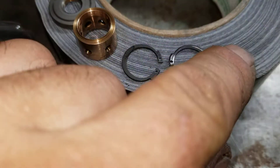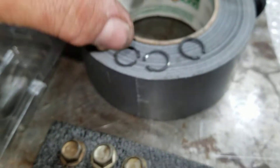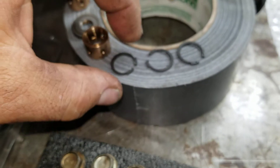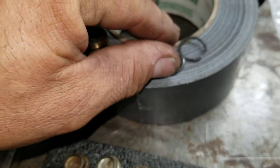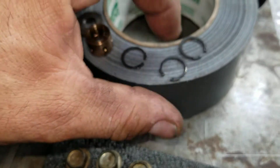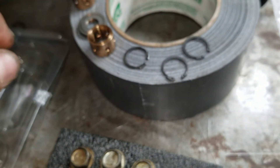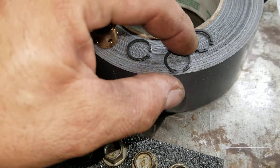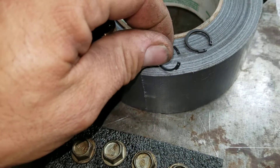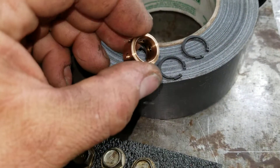See that bushing? There's one that was cutting because it was installed incorrectly. It might have been that one cutting but it was installed correctly — not incorrectly — but that is why: if you put that in wrong, that square edge right there will cut into the brass.